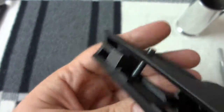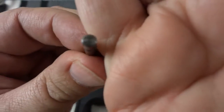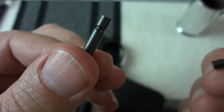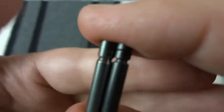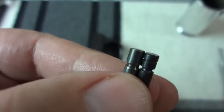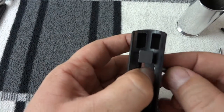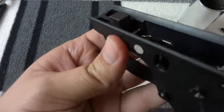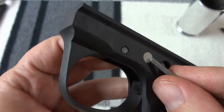I've made my pin. Essentially I just cut it off, dressed the end up, and cut a groove with a Dremel tool. You can see the groove is pretty close. I don't need the other groove, and I don't need this old undersized pin anymore, so I'll set that aside. We'll put the pin through here — you can see a little spring comes up and retains it, kind of like the old pin does.